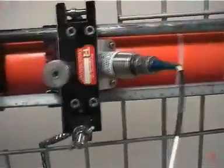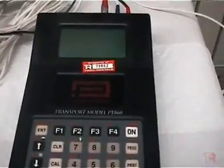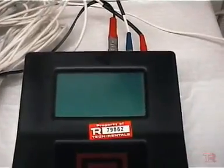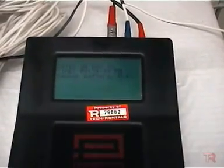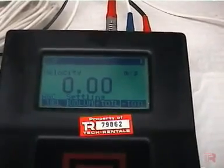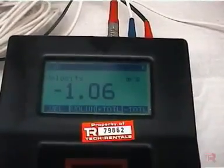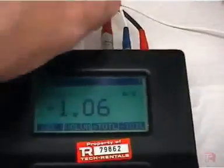Now we need to turn the system back on to get things going. I now have the flow rig running. The unit will come up and attempt to run the program we loaded earlier. We've set the transducers at the appropriate spacing and plugged them in. The negative number shows that we've got the transducer cables the wrong way around — very simple to fix, we just simply reverse the cables.